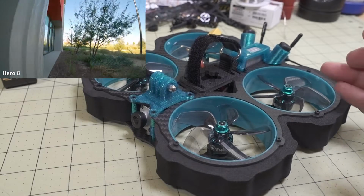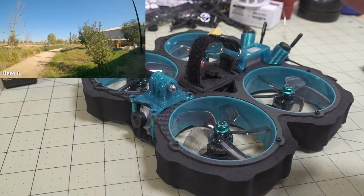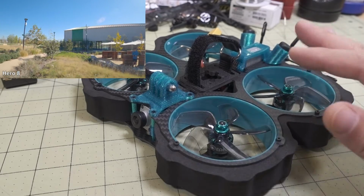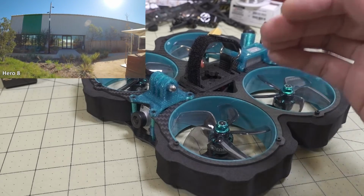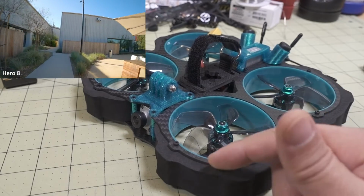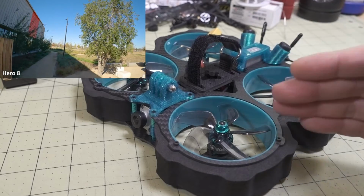If you really want to see how this compares to all the other models that I mentioned here, I'll put the link to the Cinewhoop playlist down in the description. You can peruse through those videos, check out the other models, and see how they fly compared to this one. Obviously, if you go back in history, I think they tend to fly worse. As time progresses, they upgrade to newer versions of Betaflight, enhance the PID tunes, and get better equipment, like going from 1408 to 1507 motors, for example, going to 6S, going to better props. So as time has progressed, these have flown better and better.